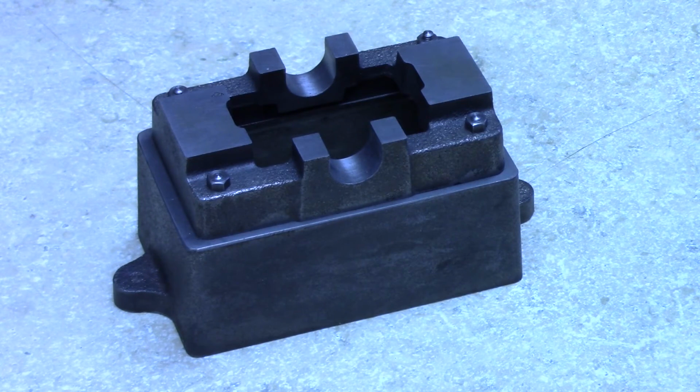It's nice to have the first two parts put together. I'm not going to be able to go any further with the sole plate at this point because, again, to make sure the holes are aligned, I'm not going to be drilling the holes for the standard mount until the standard is complete, and I don't want to do the holes for the crankshaft bearings until the bearing is ready to go in.